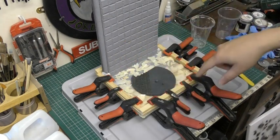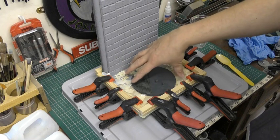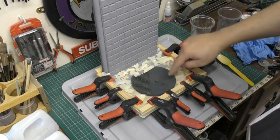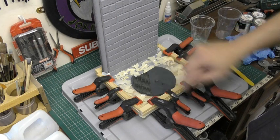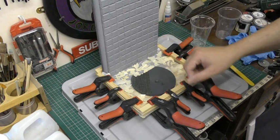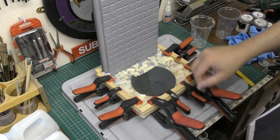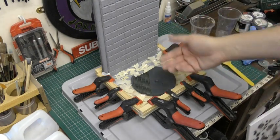Okay guys, so I went ahead and made a wooden frame basically to just fit around the side of the routed edge. For the next part we're going to fill this up with resin. Not completely, it's just going to go up to a tiny 1 or 2 millimeters over this. These are just chopped up bits of cured resin, because resin sticks to resin, so it basically just adds a bit of mass and volume.